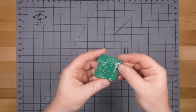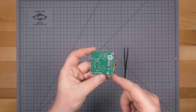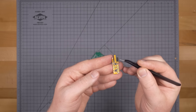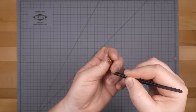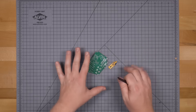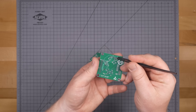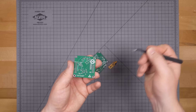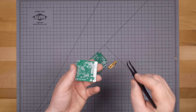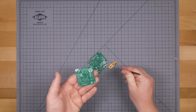You might have noticed that there are a number of other components on this board besides just the pogo pins. These will allow me not only to program the board, but also to perform diagnostics to detect circuit anomalies, all in the same fixture. A quick recap of the tile light boards that this is designed to test: they contain two LEDs, two microphones, and a microcontroller to handle digitization and communication of the microphone values. I want to verify that all of this is working, so the first feature I've added are these two photodiodes and the associated amplifier. Each photodiode will look at one of the LEDs, so I can cycle the LEDs through their colors and verify they're working by monitoring the photodiode voltage. The second addition is a piezoelectric speaker that will excite the microphones — I can drive this at different frequencies and record the results using the microcontroller on the tile light board.